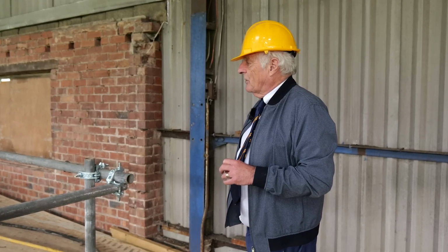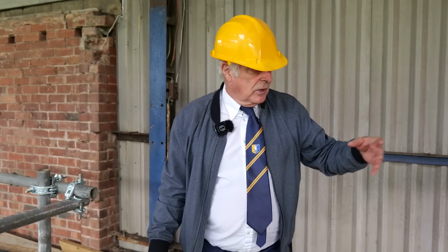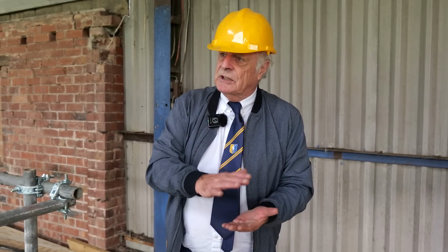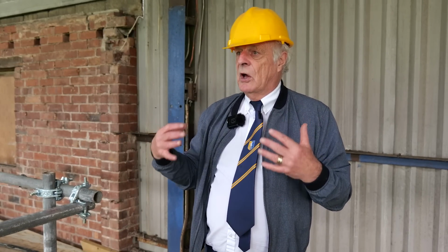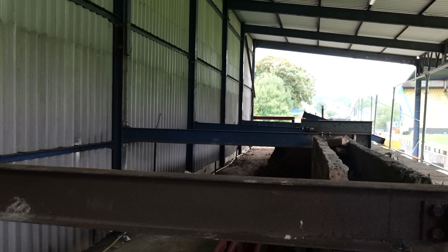Well, basically having to come in from that end and keep these in place and not disturb the frame, and the ground conditions that we came across, which have, as you've already noticed, we've already stoned that. That's been dug out, restoned and compacted, just to give us something to work on, because you have to have solid ground, which is why we had the trial holes done right at the beginning. We have to know and prove to ourselves and the interested parties that check our designs that we do found on firm ground. And you don't know that until you drill for it.